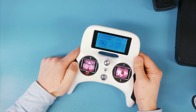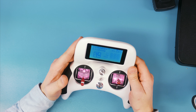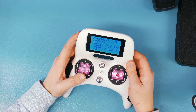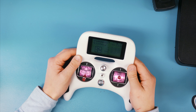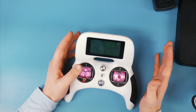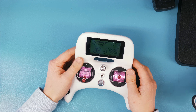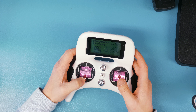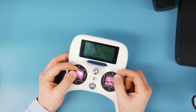One thing that is a problem with this radio is that there is no channel mixing. So this radio is strictly for quads — you can use it for planes, but it's definitely not made for that. If you want to use it with a plane, you'll need a separate channel switcher or something like an Arduino, which I covered in my airplane video.